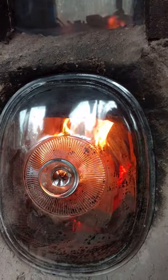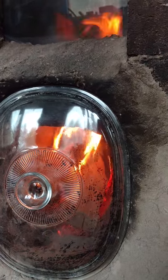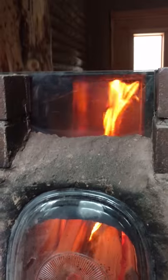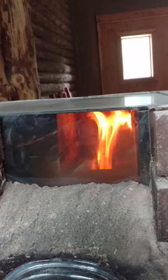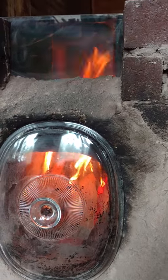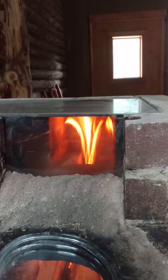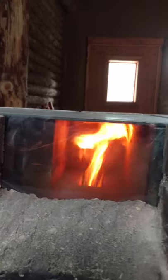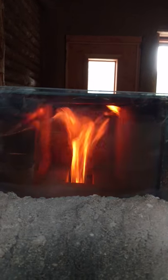It's got a firebox here that looks a lot like a batch rocket heater firebox. Instead of a heat riser behind it, it's got a slot in the top and a p-channel or a tube coming along underneath the firebox and off the back of it, that injects warm air into the second chamber up here to burn anything that didn't get burned in the first place.